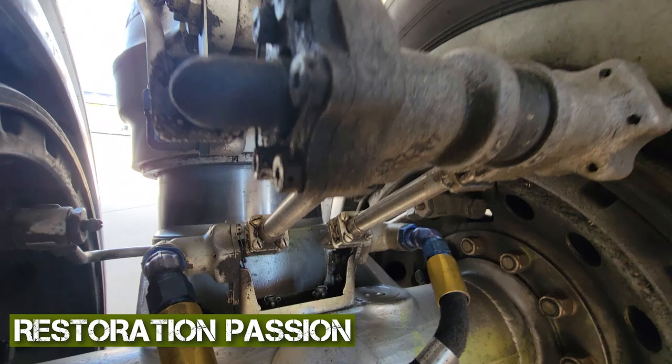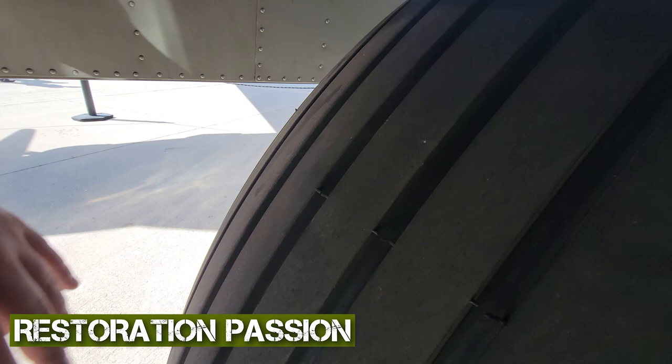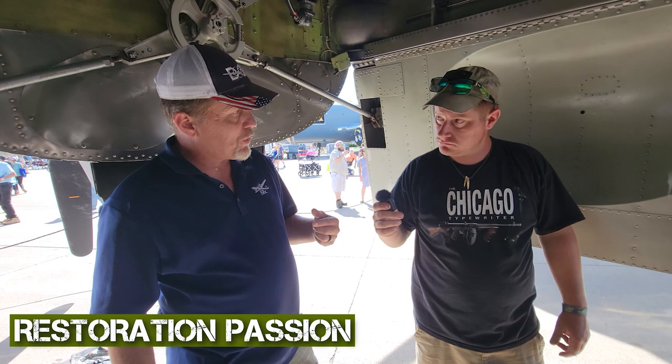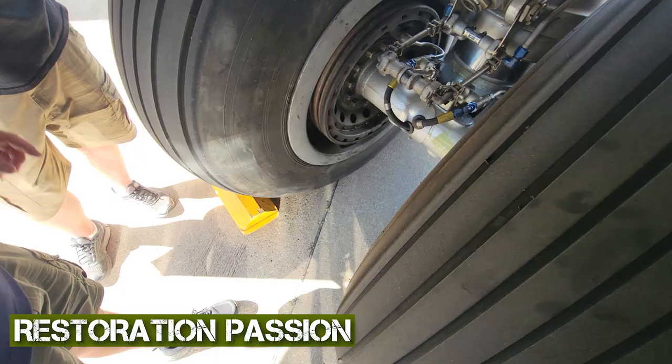So I don't see, like a typical tire has your tread wear indicator. Depending on the tire that you have on the airplane and whether it's a new tire or a retread, there are different tech data requirements for it. And so you can retread a plane tire? As long as you don't destroy the carcass. So it's measurements that you'll take, it just depends on the tire, just measuring tread depth.